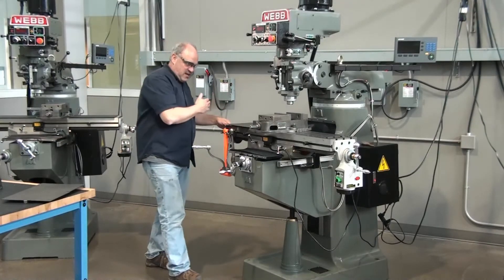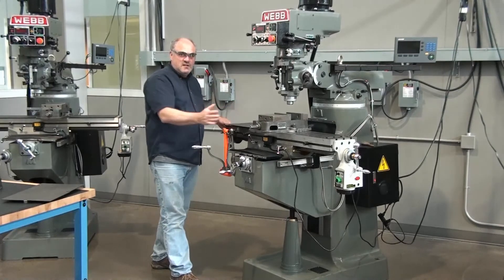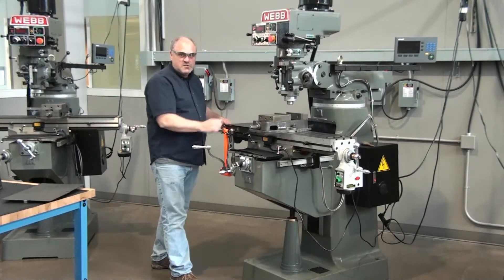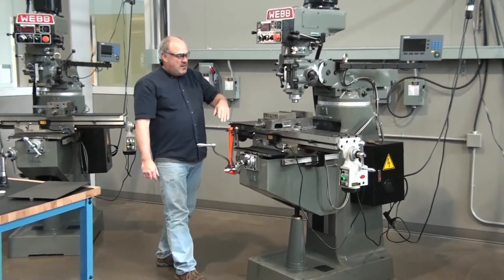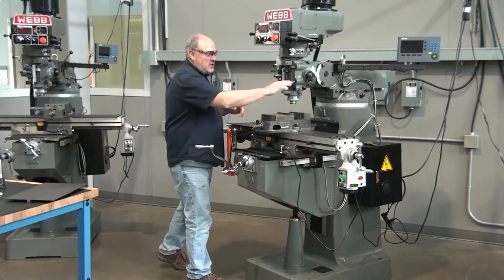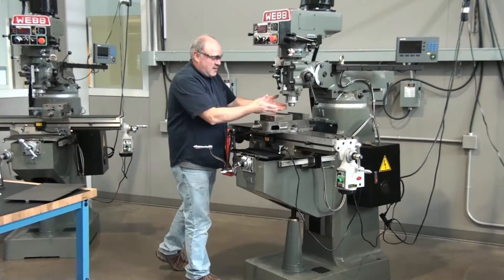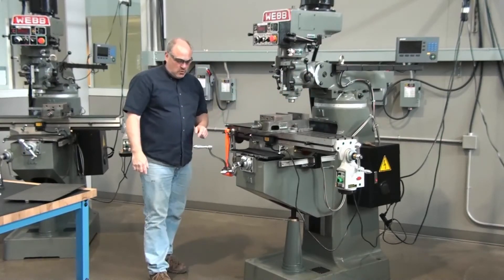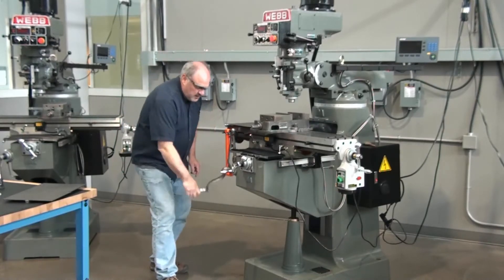Some people call this the x-axis and the y-axis. So if that's the x and this is the y, where's the z? Obviously the z goes up and down. To control it, you have rough control right here — you can put it down and lock it in. But if we want real accurate control, we're going to use this knee lever right here.